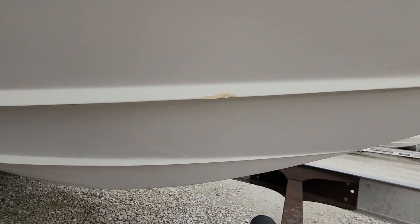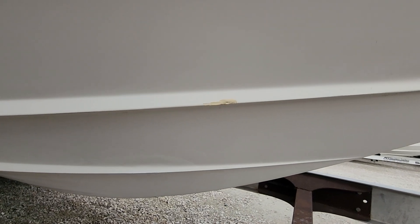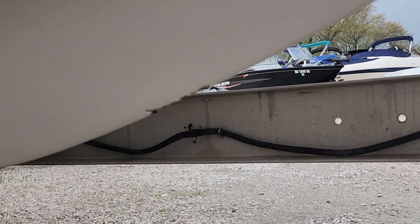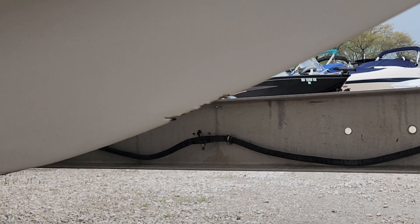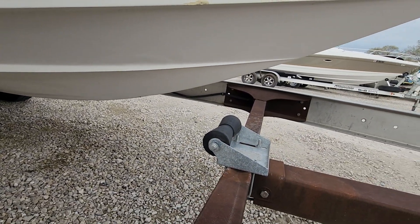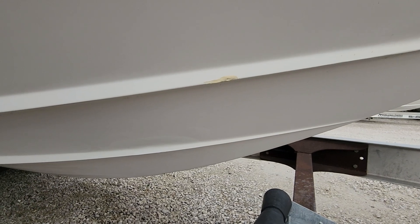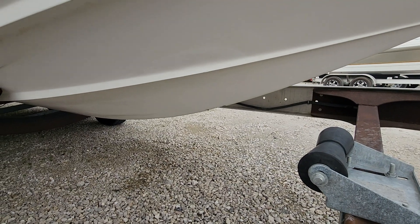No real damage. There's one homemade repair where it looks like they just filled it in with epoxy — it is sealed so I'm just gonna leave that alone. It'll be hard to get to. But I do have a chip, probably about two to two and a half inches long, with fiberglass showing that I will fix. I'll use a marine epoxy that looks better — a little whiter — and I won't just glob it on; we'll make it look as nice as we can.